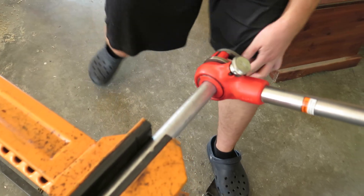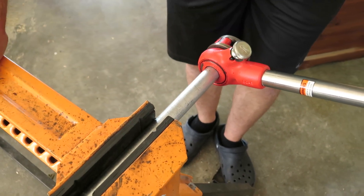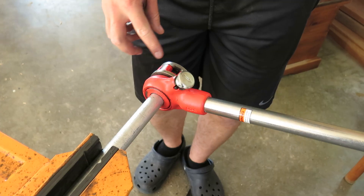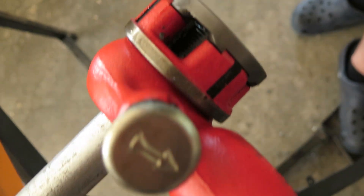Are we far enough? Just about far enough, yeah. You're going to give it another shot or is it done? Yeah, I think it's done. So I'm going to reverse the direction of cutting here just to cut the loose curls of metal off at the base of where the threads start.